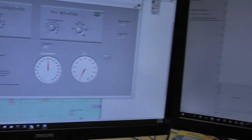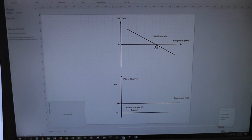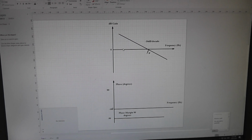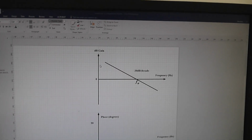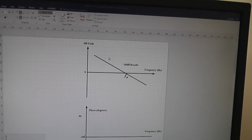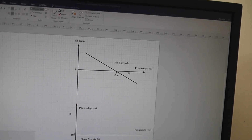So how does this work? I mean, how does gain keep the thing in place? If you think of a very simple integrator, there's its Bode plot. There's our bandwidth, it's where it crosses unity gain. It's got a phase shift of -90 degrees. At a particular frequency down here somewhere, where let's say I'm putting some disturbance in, it's got a set amount of gain there to reject that disturbance, to reduce the error. And the slope is -20 dB per decade. But clearly if I could get that higher, I could get more gain and reject more disturbance. What I could do is just increase the gain. Well, that would increase the bandwidth. That would be good, that would make it faster, and I'd get more gain.